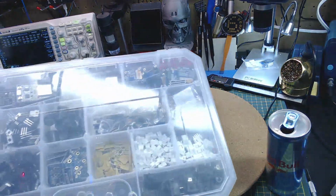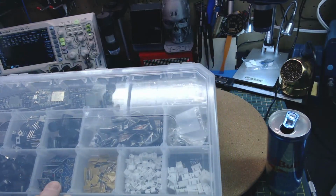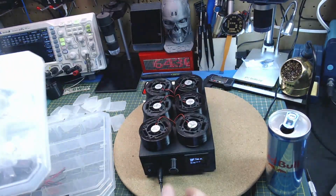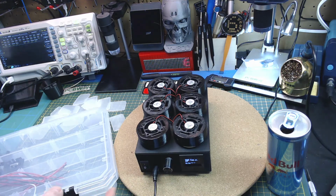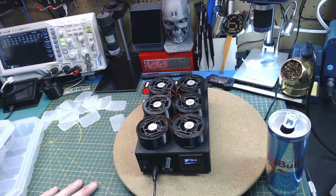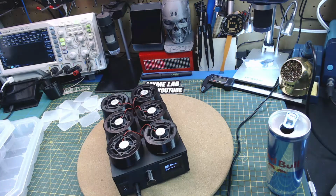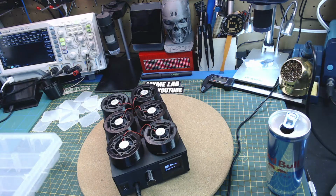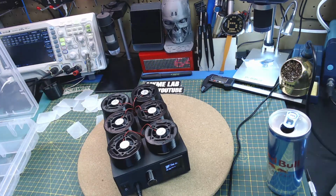And yeah, I showed it a little earlier. This is all the hardware ready to go into production. I've got everything. The I2C encoders, because I ran out of I/O, are working just flawlessly. I added that code the other night, and I have room to work with the web code a lot more. Like, I can do all kinds more stuff. I've got 20% left of storage space, and I could probably do a lot better because I'm a crappy coder. But I think I can do a lot more on the web interface that users can just hop into in their VR goggles. I think that's where I'll focus someday, but I need to get some units out